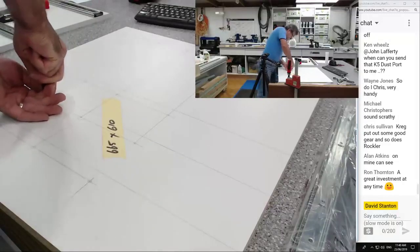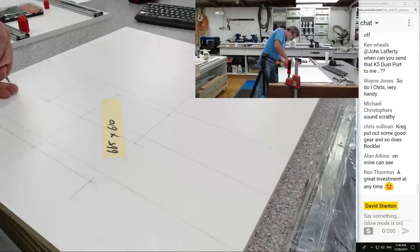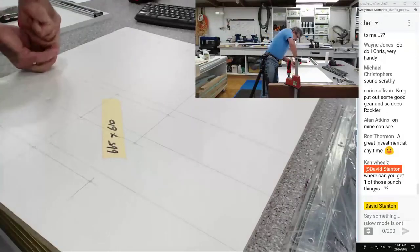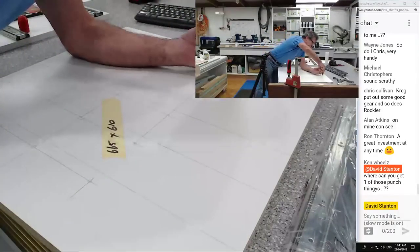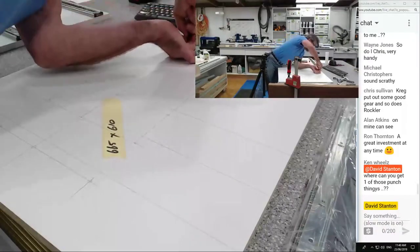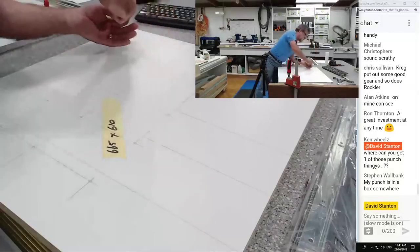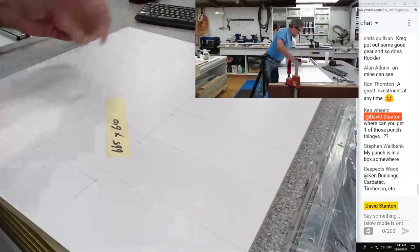You'll hear different degrees of punch as I'm doing it. Now, I'm doing this because melamine is a very slippery product, and I don't want the drill to go sliding around. I want it to actually create a dent in the product. I could use a hand punch, like a punch with a hammer, but I find this is very effective.